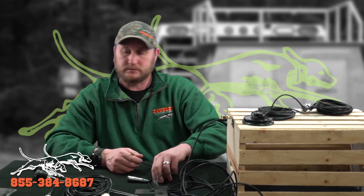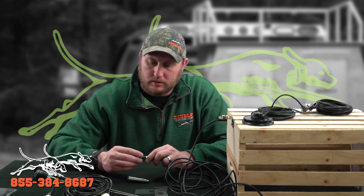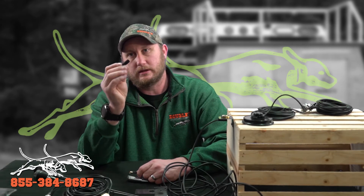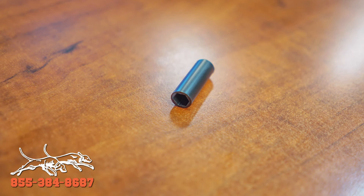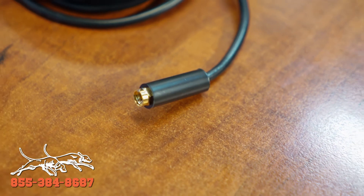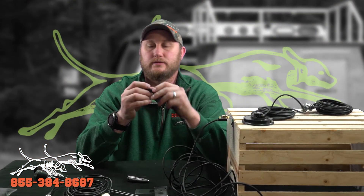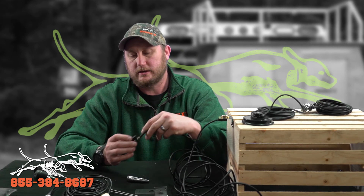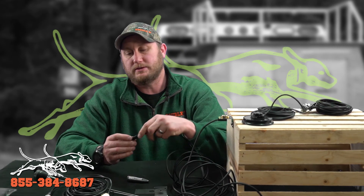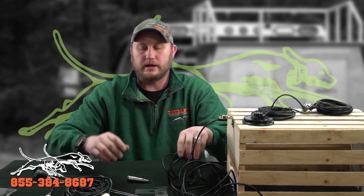That also determines if we cut the antenna to the right length. Lastly, if you order a Garmin product, we send you one of these little tools right here — we call this an SMA wrench. It just slips over your SMA connector and makes it easier to spin that knob and get your fingers on it, because with a Garmin it's kind of hard to grip the little SMA nut. It's just something extra we throw in. We have these built ourselves — you're not going to find anybody else that has these available. We call it an SMA wrench.